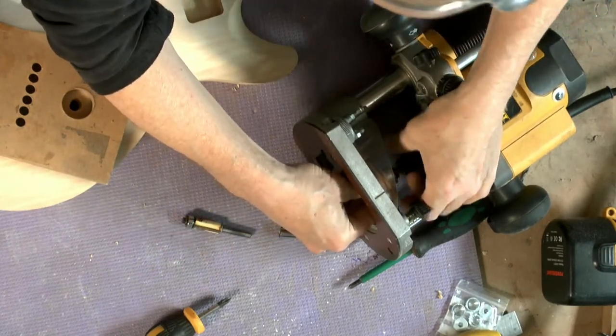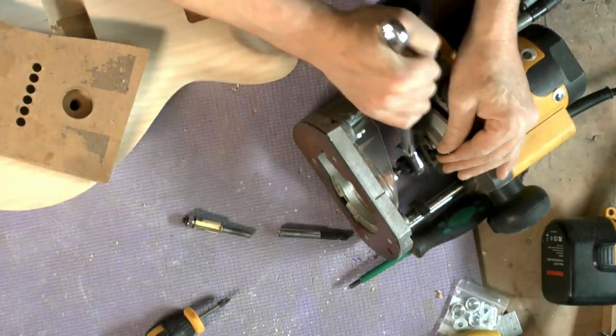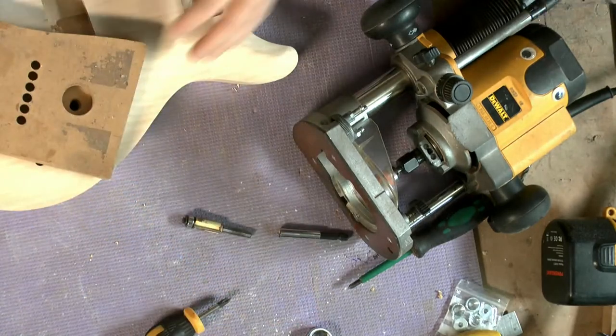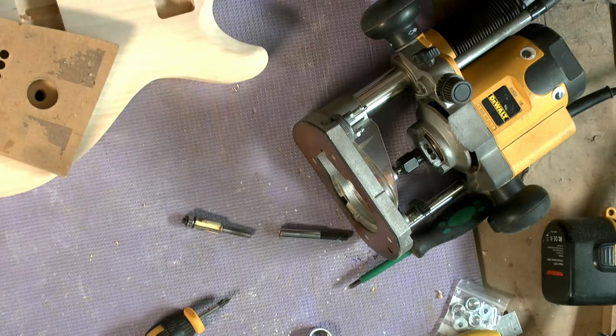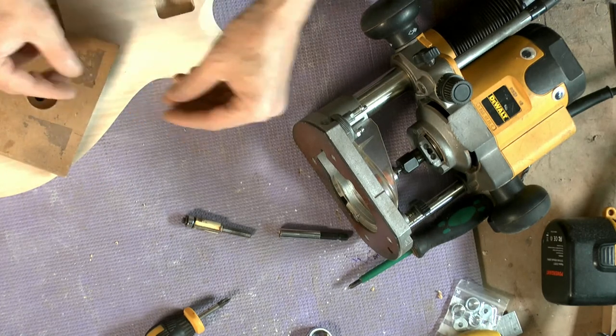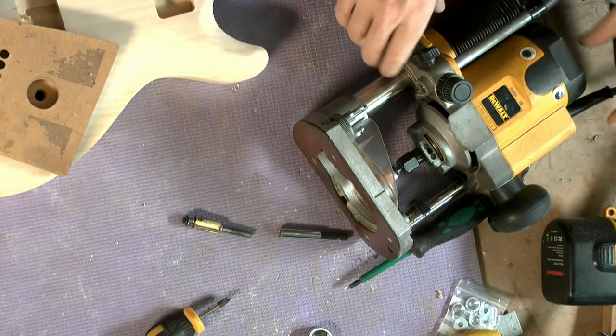Edwin Den Hertog said, have you used barrel jacks? How do you feel about barrel jacks? Tell me about barrel jacks. Okay, barrel jacks are great, but they're a bit more difficult to fit. The problem with a barrel jack is that you need to put a nut on the back of it, so you need somewhere that's flat on the inside that your nut will stick on. Not recommended for a beginner.